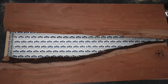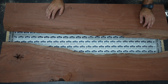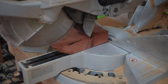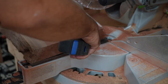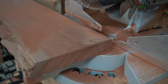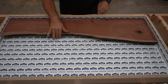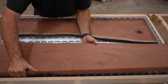With the form ready, it's time to set our slab on it and decide how we want it to look. I just play around with it for a little bit to get the look that I like. Then I mark the form on the slabs so I know where to cut them so that they stay in this orientation and fit into the form. I trim them up on the miter saw, or if they are too big, I use the track saw again. Once they are cut, I drop them into the form. I actually prefer to set the wood in the form while the caulk is not set up, so the slab pushes the caulk down and fits tight against the side. The farther it is from the sides of the form, the more epoxy you will end up wasting.